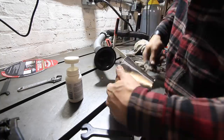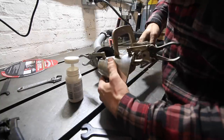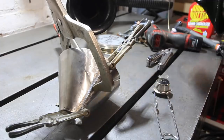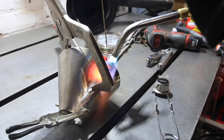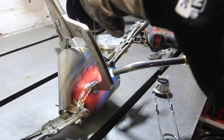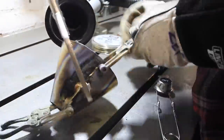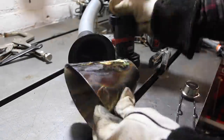I'm going to be using a white brazing flux which is nice because it has the brush in the cap so I don't have to find an acid brush every time. What's important here is to get a nice tight fit on these pieces of metal. Normally if you were soldering or brazing a piece of pipe it's a pretty close slip fit, but since this is a lap joint it's a little more difficult and you've got to combat the heat because heat will make any metal warp. I heat this stuff up with the acetylene torch, it gets hot pretty quickly, then I add the Safety Sil 45 brazing rod and it flows into the joint pretty well. I kind of over-fluxed it I think, and as a result I got a lot of the brazing alloy on parts I didn't want. It does grind off, but the stuff sticks really really well so if you get it anywhere you don't want it you definitely have to spend time grinding it off.